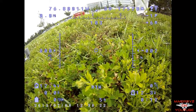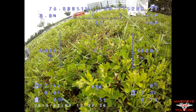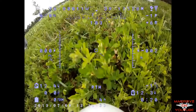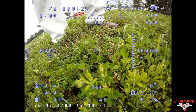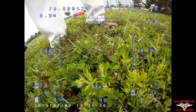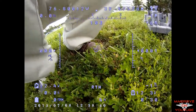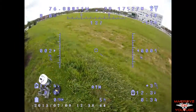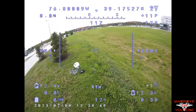With this flight, I'm flying line of sight only, but eventually I will be looking through some video goggles and I will see the FPV, or first person view, from the perspective of the plane. That's a 9 gram servo connected to my rudder channel that tilts the camera up and down. The OSD utilizes an external GPS to determine its position and provide you with the telemetry. I'm testing video quality over distance to get an idea of what my range will be. I'd recommend this for anyone trying a new FPV system.